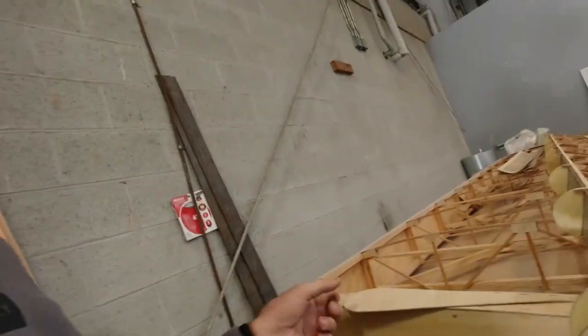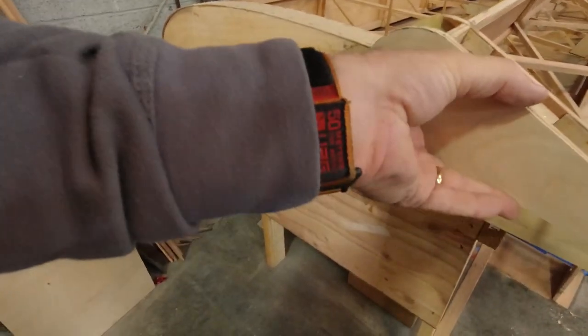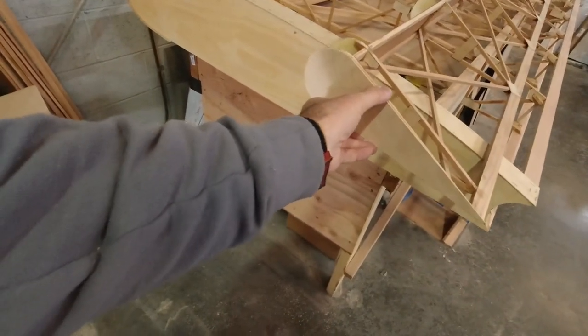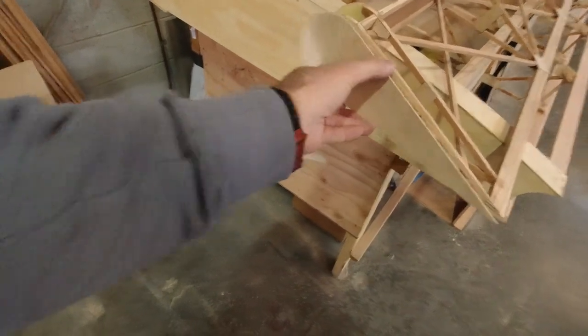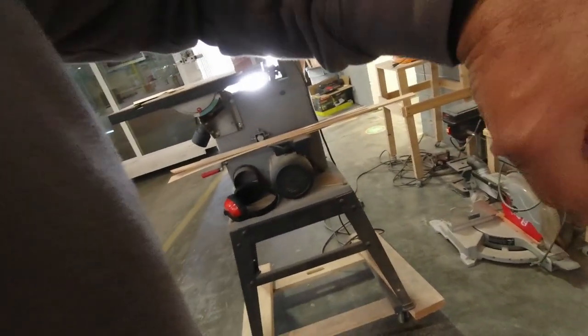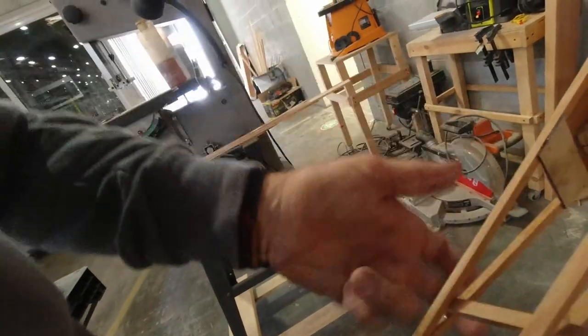All right, so I got the plywood made for the end here, the 16th of an inch, and now I'll get that epoxied on and clamped in place, and then when we come to the inside, we'll make an 1/8 inch piece that fits around here to capture that, and then we'll fill from here all the way back here with an extra 1/8 of an inch piece, and we'll do the same here. We'll just fill this whole thing in, add an 1/8 here, add an 1/8 here,